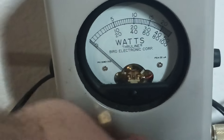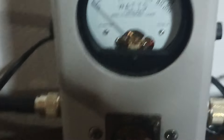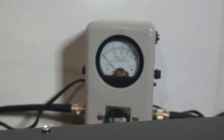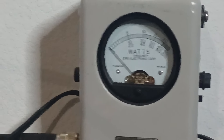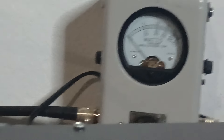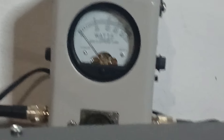Really we could hit it with like 10 watts average, you know, 35-40 PEP and it's not gonna hurt it, but I think we'll still see some pretty good numbers out of it. Still gonna be using the top scale — 2500 watts. So first thing we're gonna do, turn the amp on, and the very first thing we'll do is start out with a very low dead key so we don't overdrive it. We're gonna turn the radio all the way down and just ease it up until we get to a decent carrier. Got a little squeal in there — probably cause we don't have enough dead key. There we go — going to about 250-300.